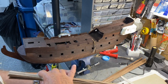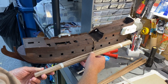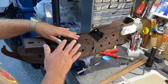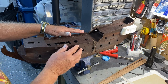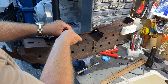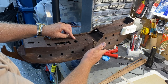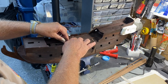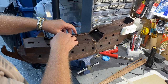The kit does come with a lot of black walnut. This is the real thin walnut that goes on the outside skin. I just happen to have a lot more black walnut available. This was designed to go on the outside, the deck, and up these side rails, but I want to make the side rails a little heavier. Because I have quite a bit of black walnut, I'm going to work this in here — I've checked and it won't make it too thick, it'll just make it a little more substantial. The instructions would have you do the outside hull first, but I'm going to do the deck, because I need to work from the center of the deck outward both directions, and I want to be able to put this side rail piece to cover any small gap that there might be.